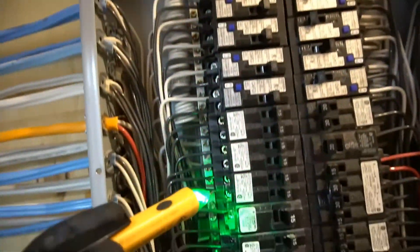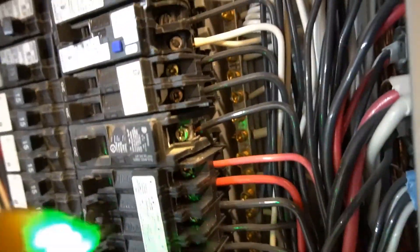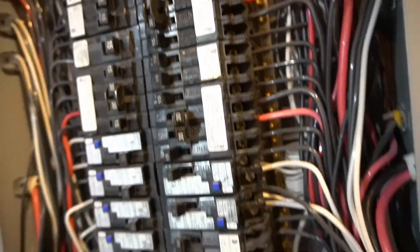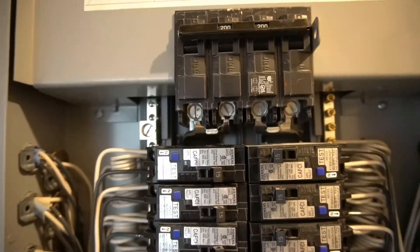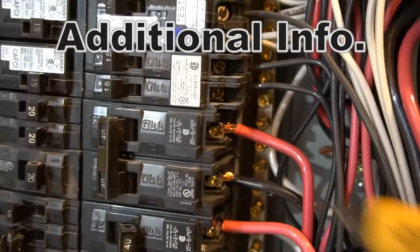I'm working live. On the side, if you have copper showing or sticking out, like this one over here, definitely do not touch — it's also live and dangerous. Remember, do not touch those parts — very dangerous. I will have to trim these down. It's showing too much copper. I will have to cut them down to one centimeter.